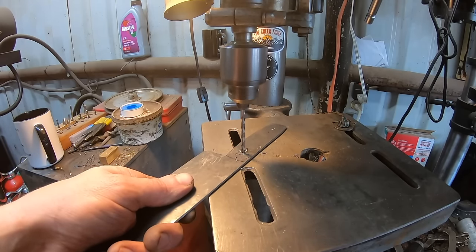I believe that's austenitic stainless, which means it never actually converts to martensite. No matter what you do with it, it stays in the austenitic phase, so it's soft. So I might have to go with that, but we're gonna get a thermocycle on this because I wasn't able to actually cold forge it for grain refinement. So we'll do that, and then we will go ahead and water quench it.